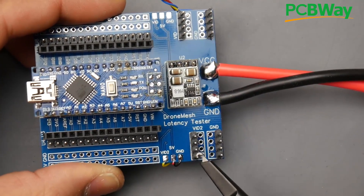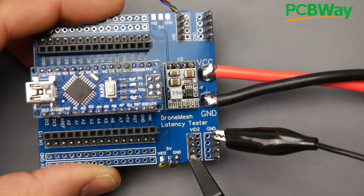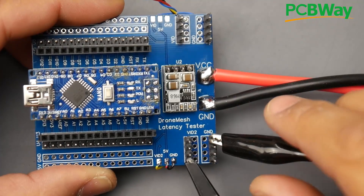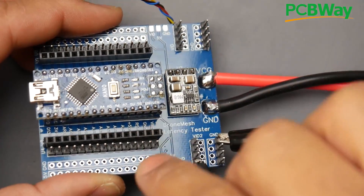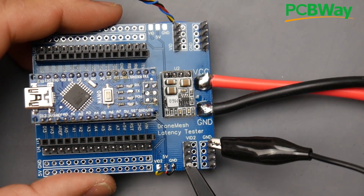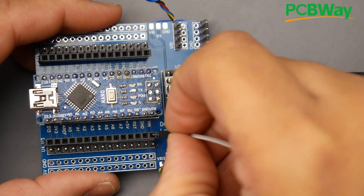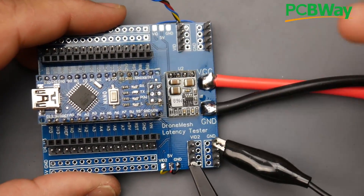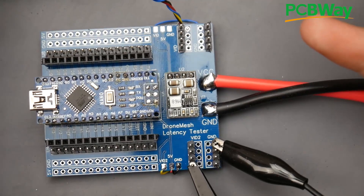I'll just come in like this with the oscilloscope probe, and then I ground the oscilloscope right here. That's it — that's for camera one or camera two, since I have two inputs. For the LED, it's going to be on D2. I put female and male headers because later on I might need to do something else, and I don't want to solder directly to the Arduino. I can just bring in these dupont connectors and install them right here, making it easy when prototyping other things.